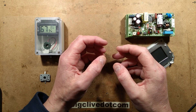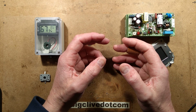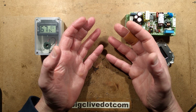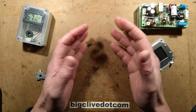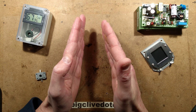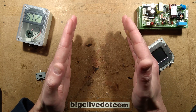A while ago, I discovered that there's a principle called electroosmosis, or ionic liquid exchange, which can transfer liquid through solid objects using electricity. This is used in various applications. On the largest scale, it's used in some construction industries — they put electrodes into the ground, pass a DC current, and it actually causes a migration of the water. It has a dewatering effect for drainage.